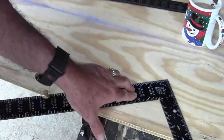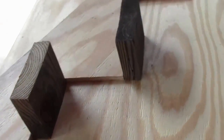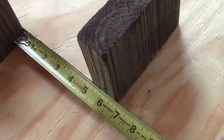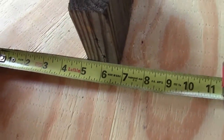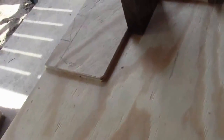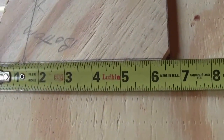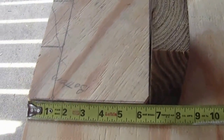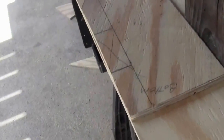And we'll just work our way up until we get 7 of these. When I put the stairs in place, or the steps, the treads, from one to the next is 6 3/4 inches, which is what it's supposed to be. So it'll be that all the way up to the top. But the very first step, even though this is 6 3/4 here, because of this tread width, is going to have to be cut off the bottom down here, 1.5 inches.